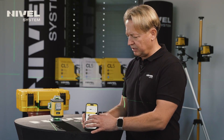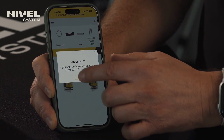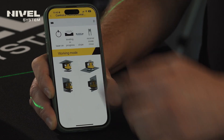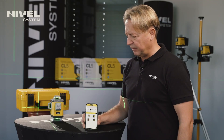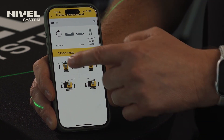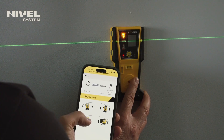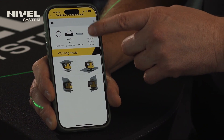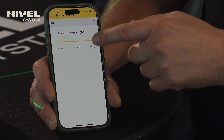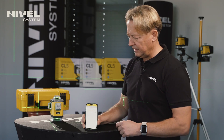The app is quite easy to use. We have the ability to turn on and off individual planes. During a break, we have the option to turn off and then turn on the beams, which will extend the battery life. The next icon is used for navigating the automatic leveling mode — if the laser is leveling, measurements should not be taken. The next icon is for cross slopes: using simple intuitive commands, we can tilt the plane either longitudinally or transversely. To exit slope mode, click the slope icon again. The last icon is for switching to the mode of working with a laser sensor. We also have the option to adjust the intensity of the displayed laser beam depending on whether we are working in a darker or brighter room.